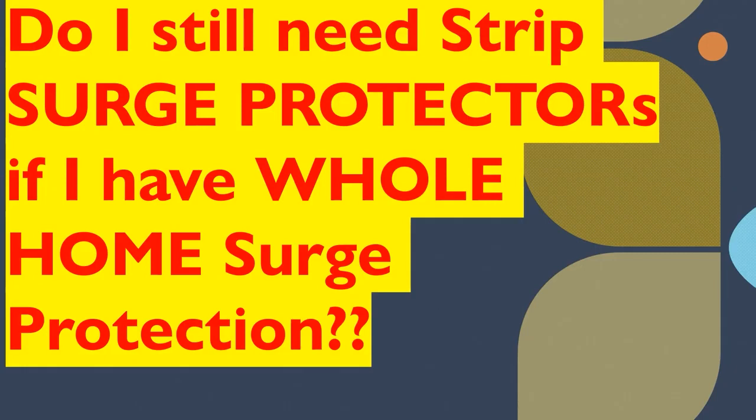There are a couple of reasons. You could get surges from other areas, and it's not just about it frying the piece of equipment. A high surge spike could fry your computer completely, but one thing you might not think about is it not only could fry the device — it shortens the lifespan of the device. Those devices are built for a constant 120 volts, or whatever your system voltage is in your area. Here in the United States it's 120 volts, so they're built for that constant 120. There is a range where they operate safely, but the lifespan is going to start to deteriorate for these electronics.